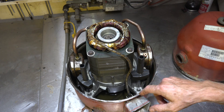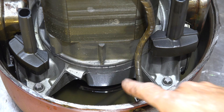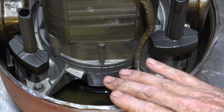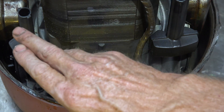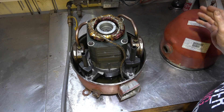If you look down there you can just barely see there's an oil level under there — that's about where the oil level normally is. As liquid refrigerant gets inside, it mixes with the oil and starts raising that level. It has to get pretty close to this high for the compressor to actually suck liquid into the cylinders, so the elevated suction placement is a protective device.